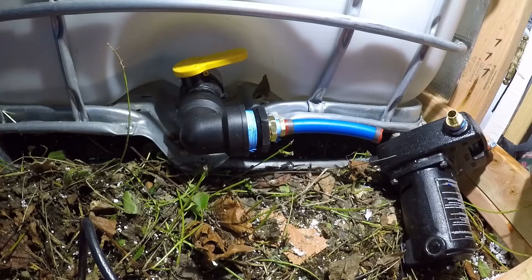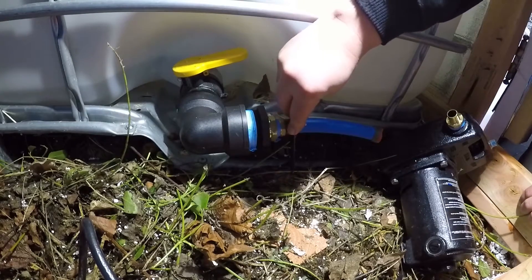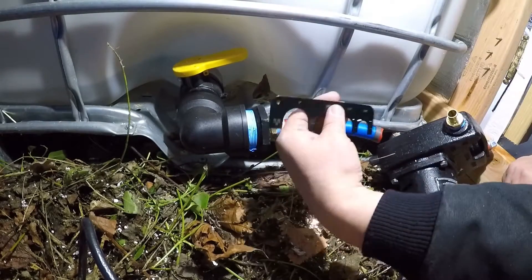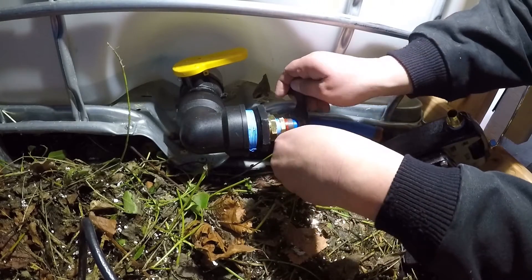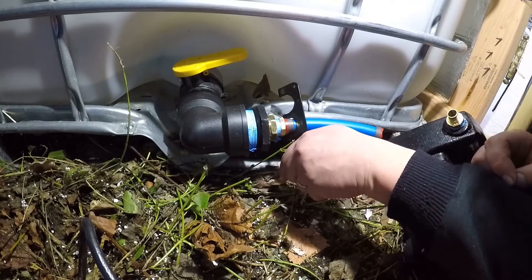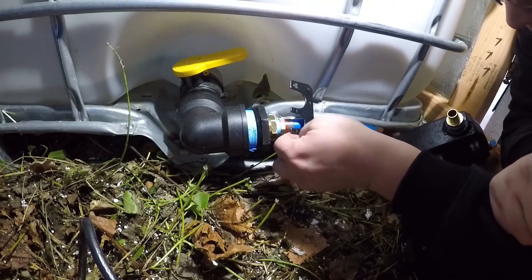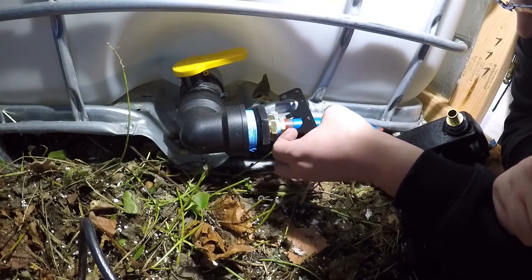Okay, let's use our little go/no-go gauge and see if we're good on that. So our three-quarter go/no-go — perfect. On the gauge, if it slides all the way on it's not good, and if it doesn't slide on far enough, it should land right there — which is really hard to show in this shot.